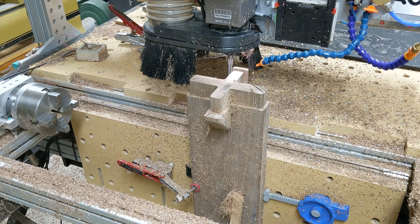One thing to remember when doing this manual trim using jogging is to set your jog rate down to a very low percentage so you're not going too fast and getting a lot of chip-out. My normal jog rate is 600 inches per minute, so I override that with the Mach 4 jog rate slider and set it to about 5%, which puts me around 40–50 inches per minute — similar to my normal G-code machining speed. It's a little quicker than reaching for a chisel and bandsaw. Just be careful not to jog too fast or you'll tear out the end — I learned that the hard way on my first one.